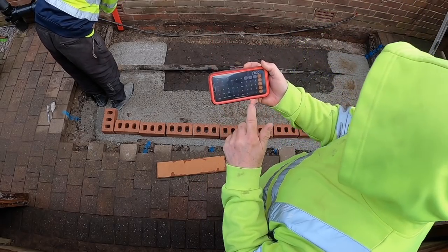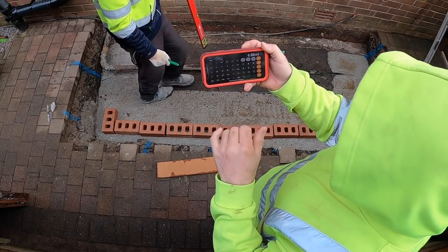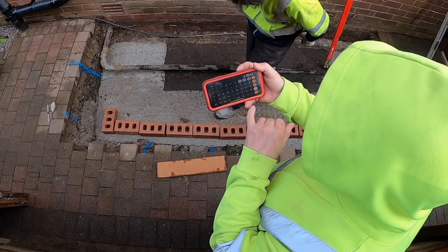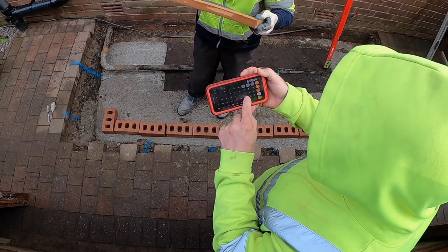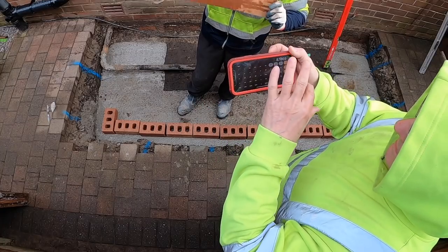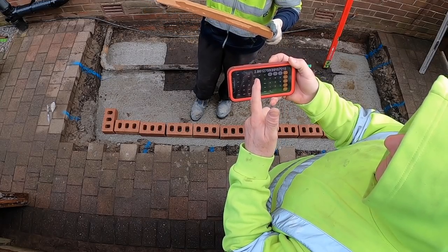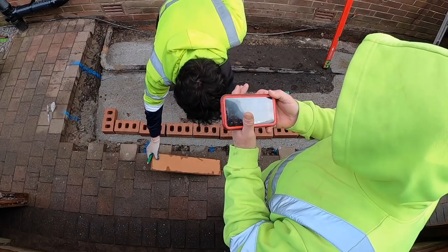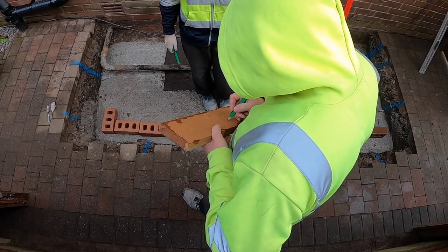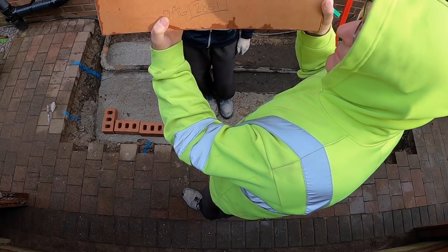2.620 squared is 6.86 and so on, plus you add that to your side number. 1.3225 equals 8.1869. So now to get your diagonal, you square root it. Pythagoras. So it's 2 metres 861. That's the only thing from school that I still use. A squared plus B squared is C squared. That's right. There's our diagonal, 2861.